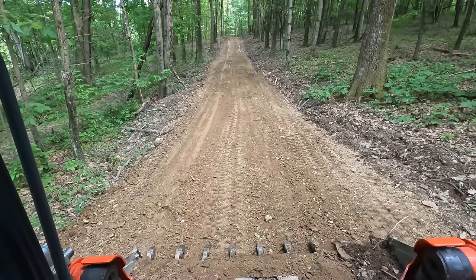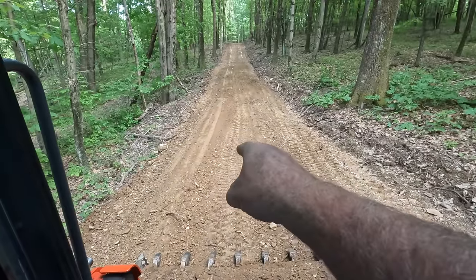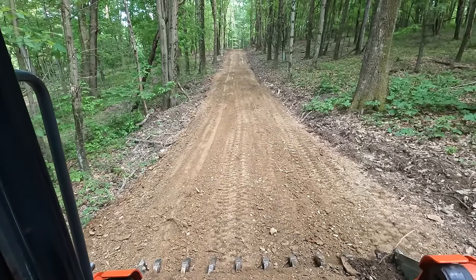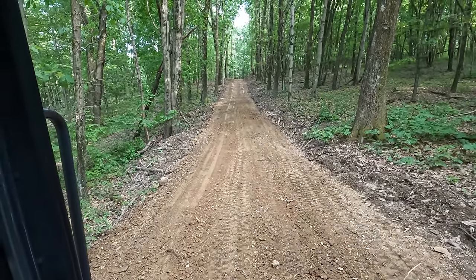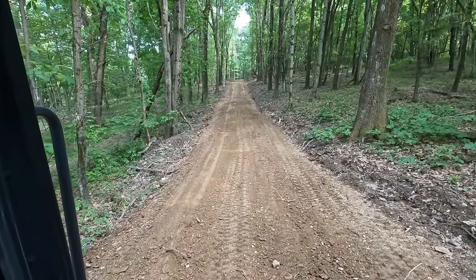This road is coming out beautifully. Really, really nice. I put about maybe 1.5 feet of fill down here in this dip. We have a nice consistent grade going up the hill. Then it levels off for a little bit, drops down slightly to the turn, just enough for water to flow. But yeah, it's solid. I mean, it's solid road. Really good. If you've been watching our channel for a while, you know that I don't care what anybody else does, but I will tell you what I did on this road and the reason it's turning out so good.